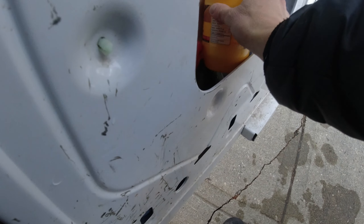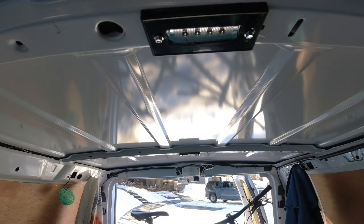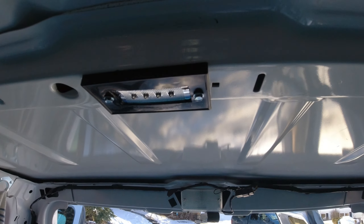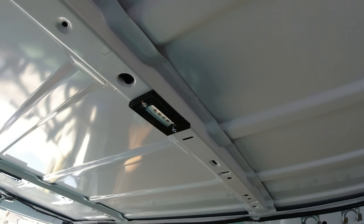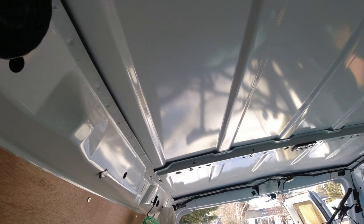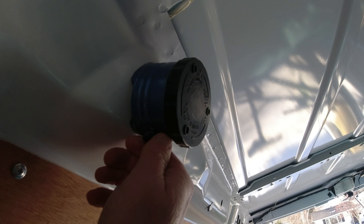For lighting, I bought a $4 LED lantern from my local dollar store. It has a triangle of three panels of LEDs that provide light in every direction. I eventually took it apart and separated the three panels, adding long lengths of wire allowing me to mount the panels separately along the roof while mounting the base of the lantern above my bed with the switch.